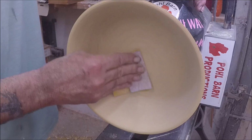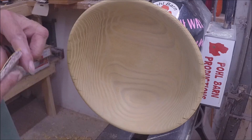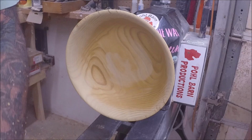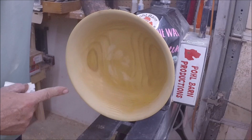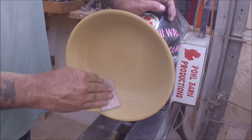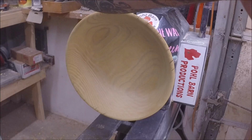So I'm gonna do some more. We'll go the other way, see if I can get that to fold off. If not, I'll hit it with sanding sealer. And when we get there, we get there. A couple spots that I can't get to go away here, where the grain turns around and goes the other way. So I'll try to make them go away. Right there and right there. Okay, well, I have to work on that some more. But yep, you get the idea. So I'll be back when we get to the other stuff.